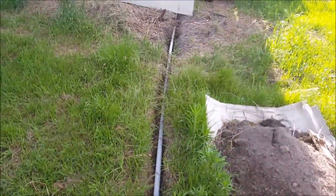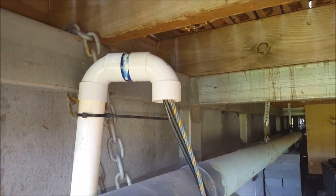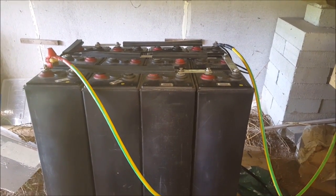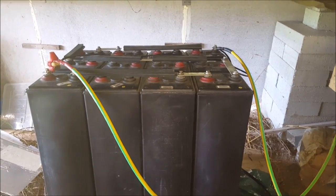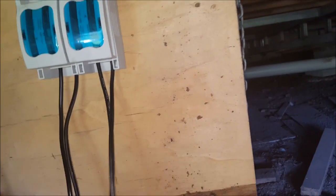There's a shallow trench that goes up under the house, with another U-bend there. There's my battery bank: 12 two-volt, 630 amp hour batteries in series to give me nominal 24 volts. Cable from the panels — both positive and negative — go into this fuse.